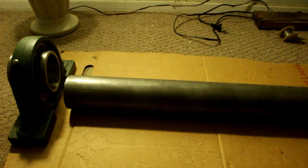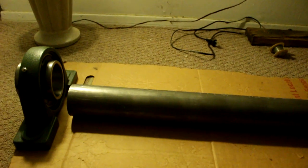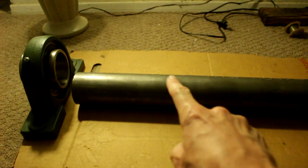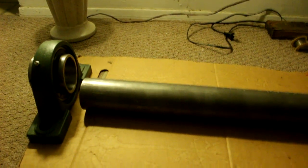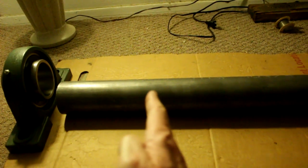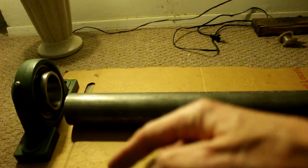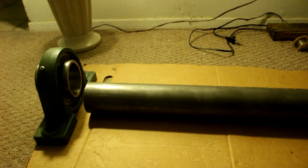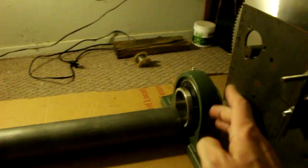The winding wheel is going to be mounted in this area and the spokes are going to go vertical, 360 degrees — similar to a colliery wheel. It's going to be a four-foot diameter wheel and it can handle anywhere from 600 to 1,000 pounds. The second half of the axle is going to go right into the gearbox.